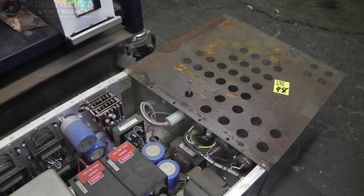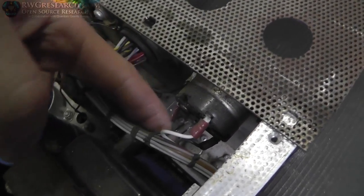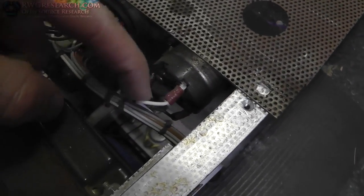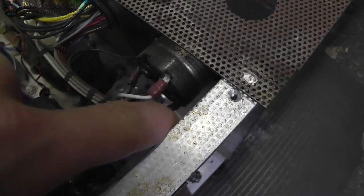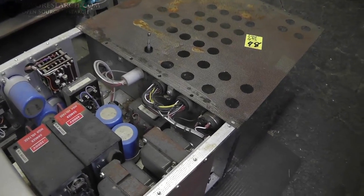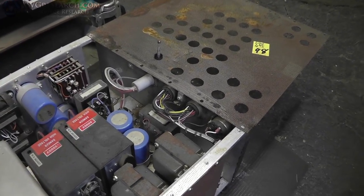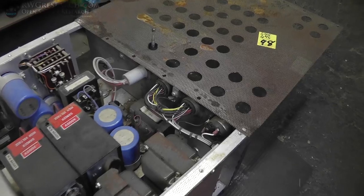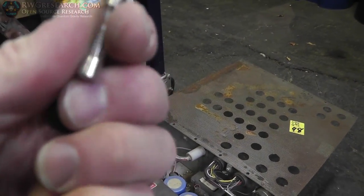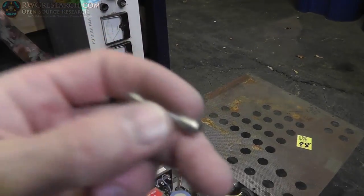Well, I got some good news and I got some bad news. Good news is, our secondary pin right here goes right to the case. This is neutral, this is hot, probably going to be 110 volts. Not sure why they put that plug on there, but I do not suspect it being a single input 220 like that. It's probably 120. So I went ahead and took the fuse out and bada boom, bada bing. Yes indeed, this is a 4 amp, 120 volt fuse.